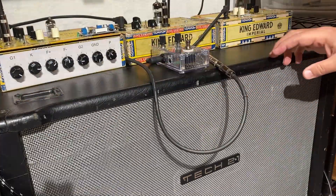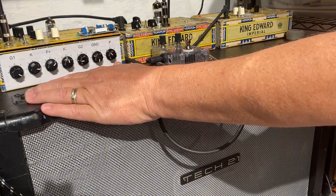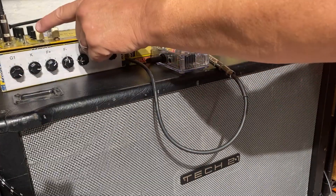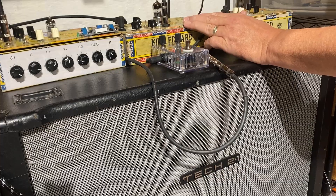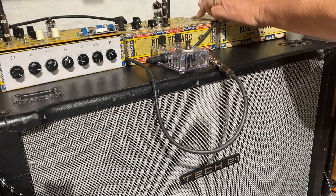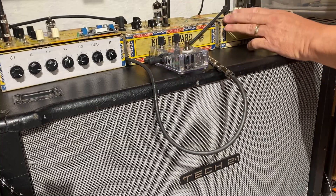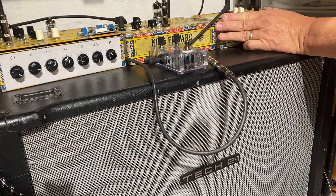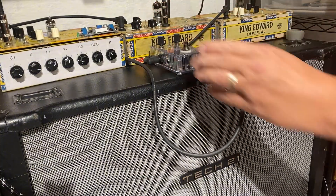For my third experimental setup, I'm first going into the universal gain stage. From there, I'm coming directly into the cathode follower to act as a buffer. Then I'm taking the output of that into the volume and tone control, which then feeds into the EL84 speaker driver. Give that a second to warm up.